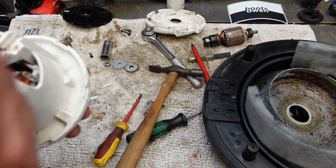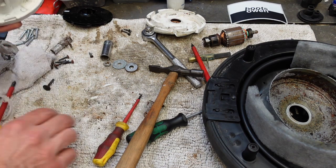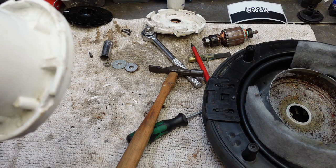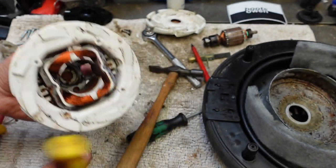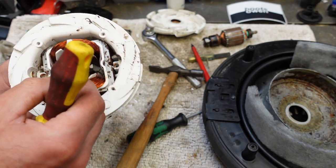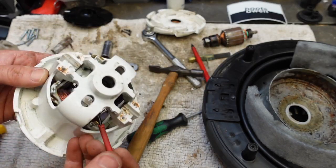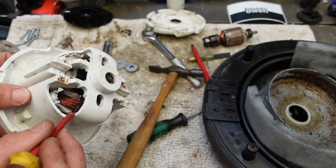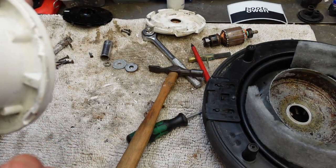We lost a spring washer that goes on behind the motors - I have to remember that. It's rusty on the laminations in here, but that doesn't matter - doesn't stop it working. So it was staked here and here. So I need to remove one winding, get the wire out. I wonder if I could do that from where I stand - I might be able to on this side. Pop that wire out into the center like that. And on this side - there it is. Pop that wire out. The wire is loose already. Just need to catch it wherever it is here. Dental picks are good for stuff like this. So there's one wire.